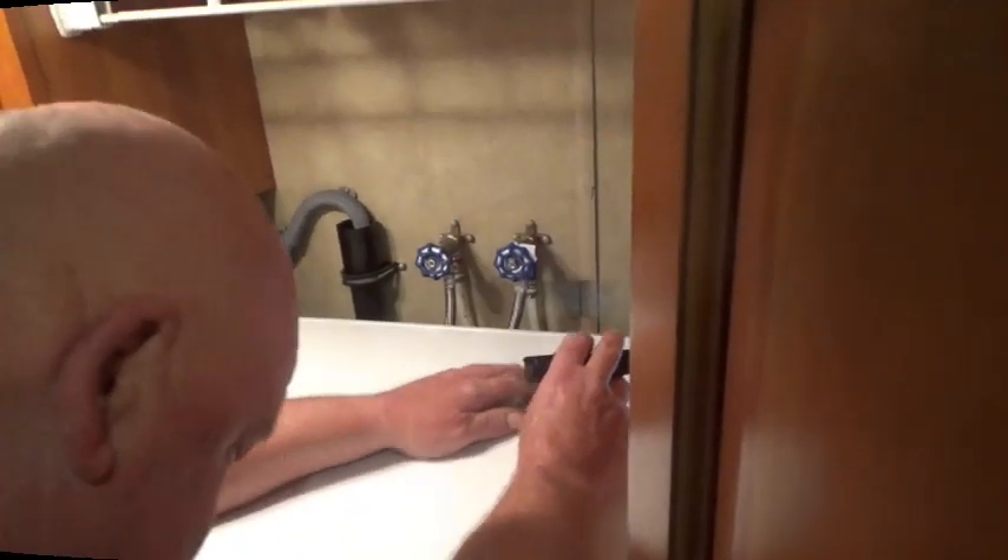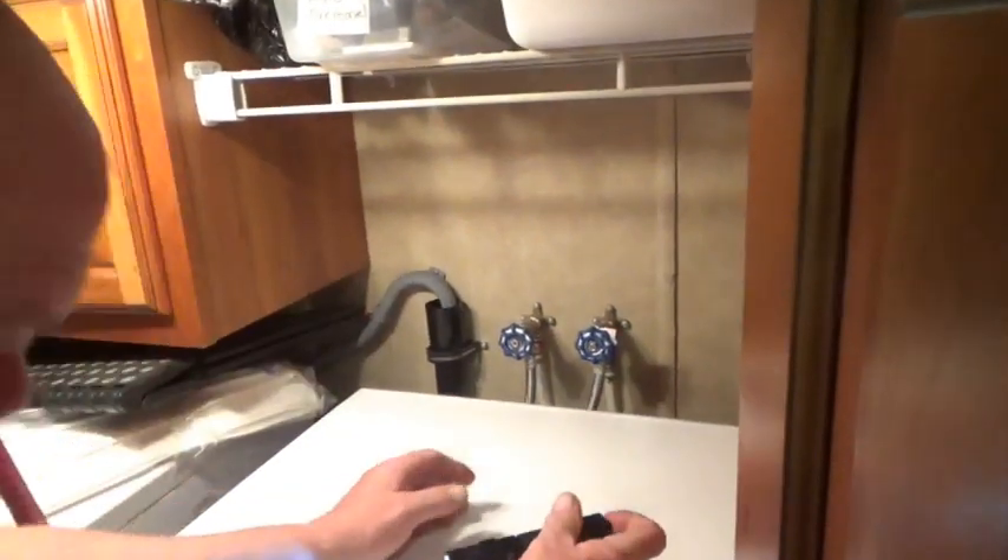I just did a load of laundry. Check behind there just to be on the safe side. I got water on that trap. You do? Yep. So there's two leaks. You think you got a cracked trap? Could have a cracked pipe — that connection, glue that's loose or something. That means you got to take this whole thing out. Watch — see it moving? That's it, it's loose. So we had more than one problem. Why they wouldn't do that with a solid glue joint is beyond me. Because it's back there, it's hard to get to. You just glue it up — it's done, it's not going to shake loose.